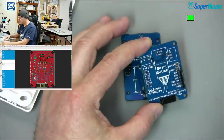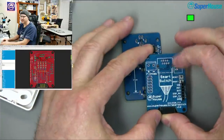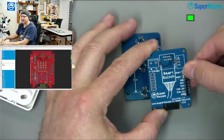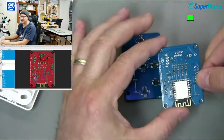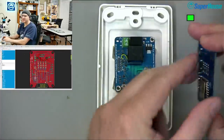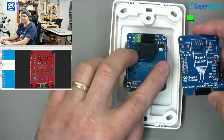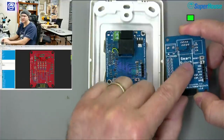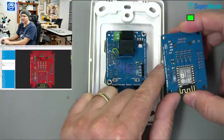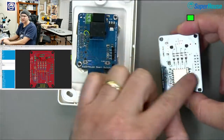I put some funky artwork there to show where the cable is going to be when it's plugged in. I should grab a couple of connectors and solder them on. The other change is that it's got reset and boot buttons on the top, but all of the other parts are on the bottom now. Unlike the previous one, where I put the ESP module on the bottom and all the other parts like transistors for the button interfaces on top. On this one, all of the surface mount parts with the exception of those buttons are on the bottom — everything is on the same side, which is nicer from an assembly point of view and means there's a whole lot more space.